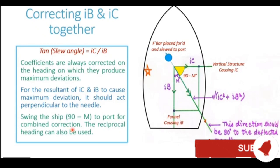Now another option which is available to us is if this resultant vector acts in the westerly direction. If it acts in the westerly direction, even then it will be acting at right angles to the compass needle, and this will happen when the ship is on a reciprocal heading to the initial one. If you swing the ship 90 minus M to port, we obtain one of the headings, and also on a heading reciprocal to that, 180 degrees apart from that, you will see that this is the second option available to us to correct IB and IC together.